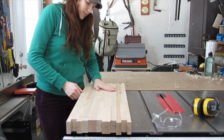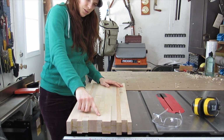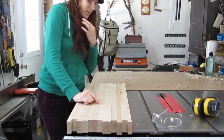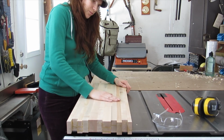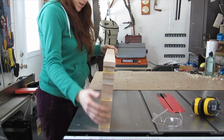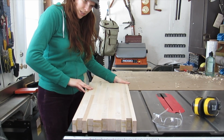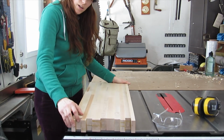Okay, so I sent that through the planer, and lesson learned, don't put curly maple in a cutting board unless it's all curly maple. I thought I was taking light passes to avoid chip out, but grain direction, there's some pretty significant chip out. I'm going to have to deal with that during sanding, unfortunately, because whatever I tried with the planer, it just kept getting the same results.